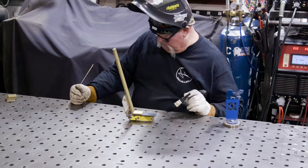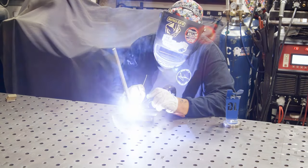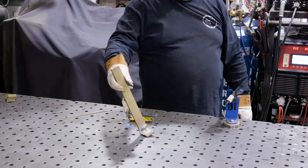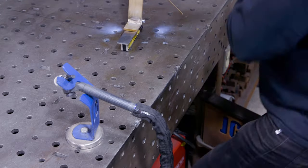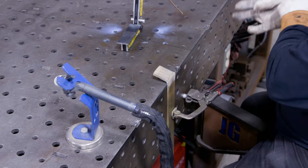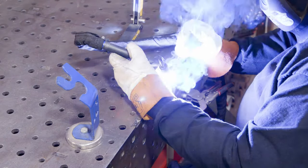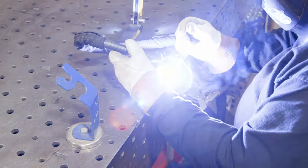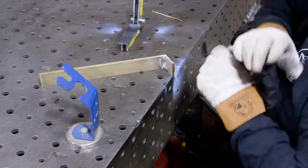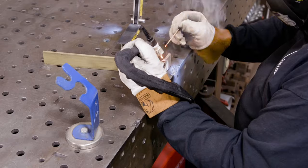This is my little jig setup right here. This is my first go at welding brass. I'll tell you my settings: I'm operating off the HTP Invertig 301, running about 200 amps, about 30 CFH pure argon, on DC. There is a fine line of heat here — if you're too cold it doesn't happen, if you're too hot it just explodes on you. The impurities in the brass, the zinc that's in there, it just pops and cracks. That fine line of creating a puddle with brass is really, really small, and I learned that right away.